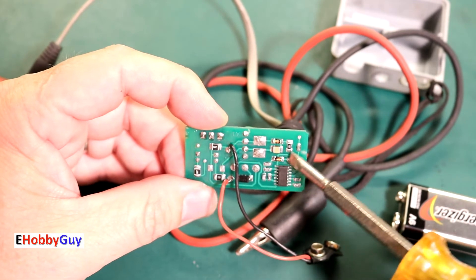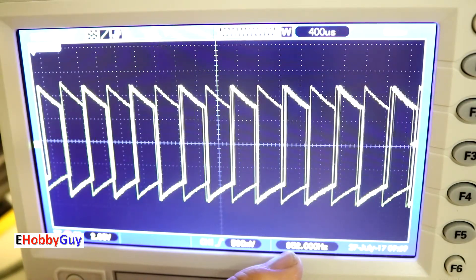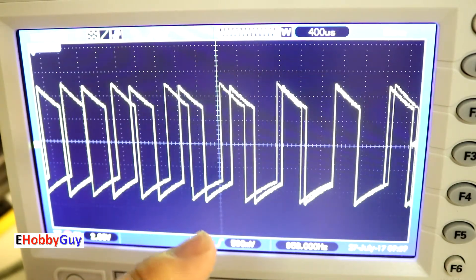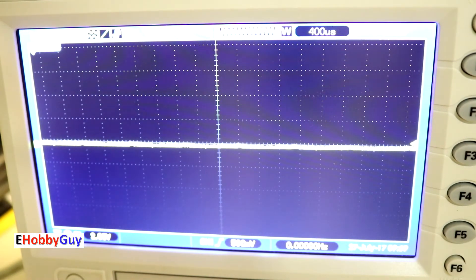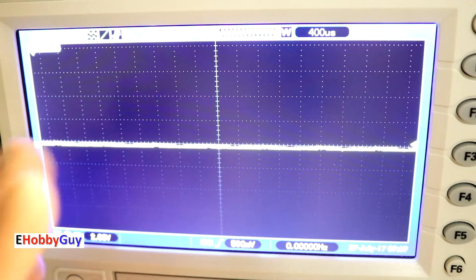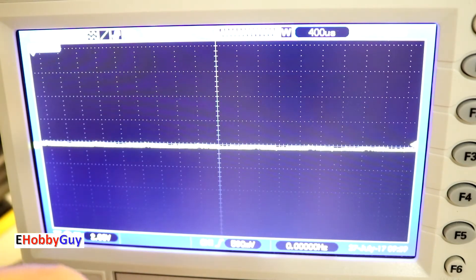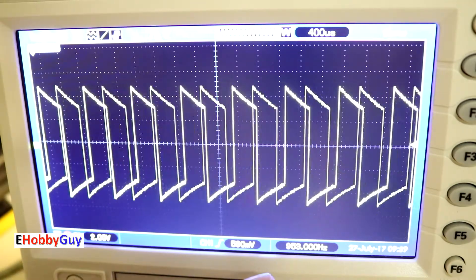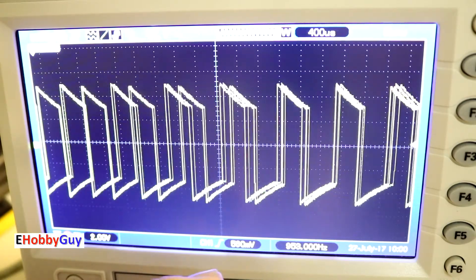That makes me curious about the actual operating frequency. Looking at the waveform on the scope, we are at about 952 hertz. I did notice — and I did not catch this until I hooked up the scope — that when I move the battery the trace goes flat, but the bi-color LED is still very dimly lit. Moving it again, there it is back. So I am going to replace the battery connector — the red and black wires could have been squashed against the back of the board.